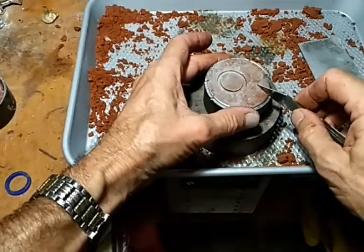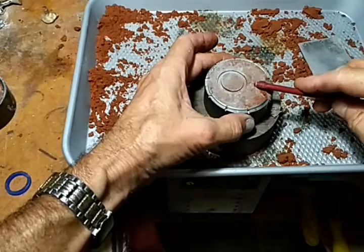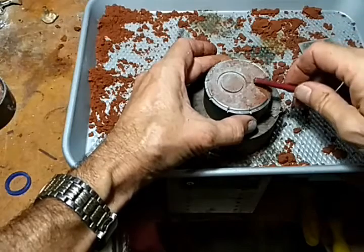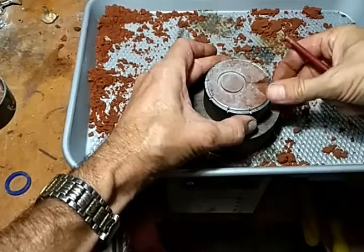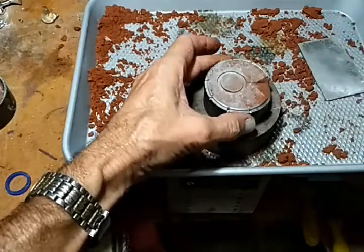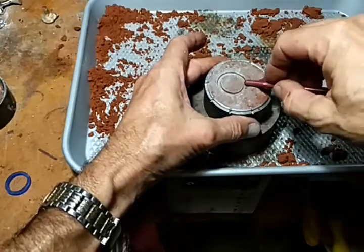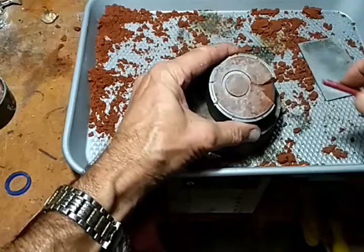I like to open this up so that it's a steeper funnel. So that metal, when it goes in, it goes right down the hole. And you want to pack this down good and solid because you don't want any little pieces of sand going down into your casting. And even widening the hole as it goes into the ring there, it'll flow better.